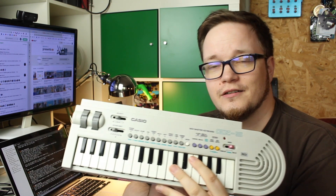So let's talk about the raw setup — how I imagine the project to work. I have basically two MIDI devices: this tiny keyboard here and then there's my computer. My tiny little keyboard has two modes. The first mode is just to play notes and the second one is MIDI out. If I turn on MIDI out, I don't hear anything anymore. I designed a little MIDI adapter board so I can get the MIDI output from the keyboard into the Arduino and then forward it to my computer. Then in my computer, I can start GarageBand and play some tones via the MIDI output of the keyboard.